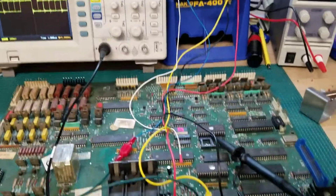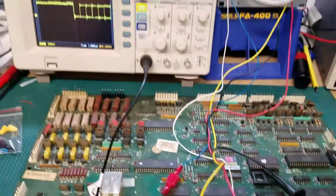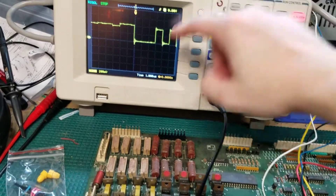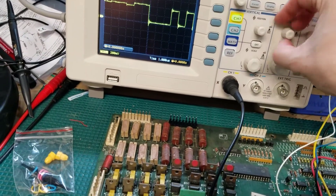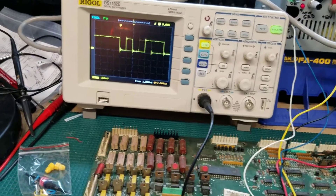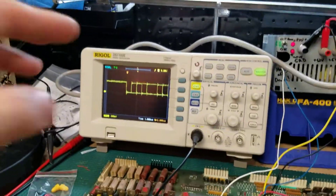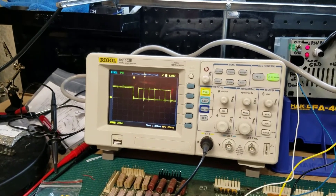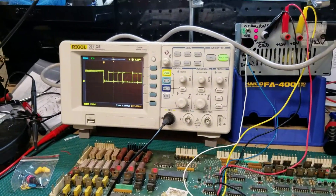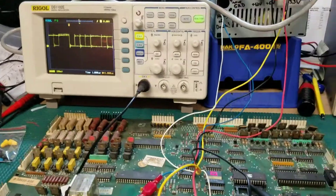Some of the things I'm just playing with here — I'm connecting out to one of the ROM chips, which I believe is one of the data bus lines. I'll have to confirm that. But we can actually see that information. We see a lot of specific things happening on that data bus line — we don't have a line that's pulled high or anything of that nature. We're seeing a lot of data being sent. If you have a situation where a line is pulled high, or you want to dive deeper into what's being sent, you've got the ability to do that. Really interesting and a great learning experience working with the board and the oscilloscope.